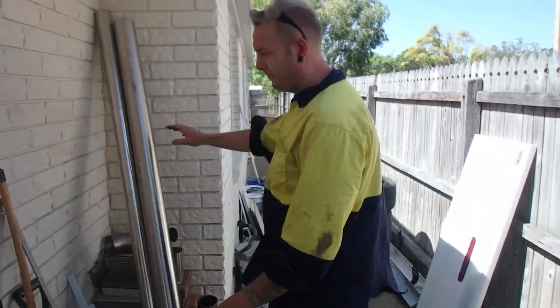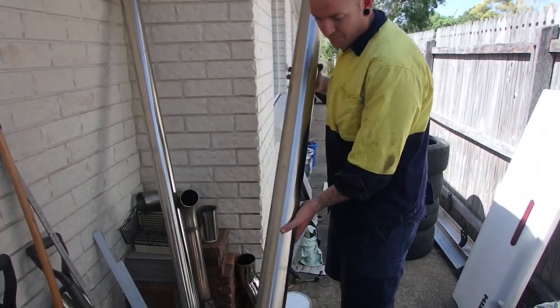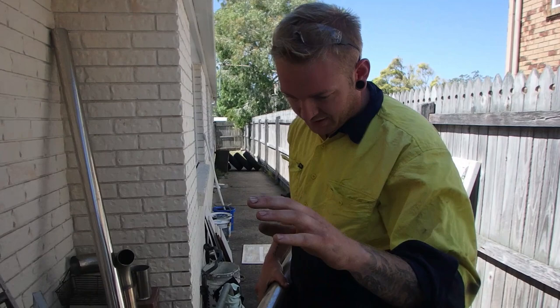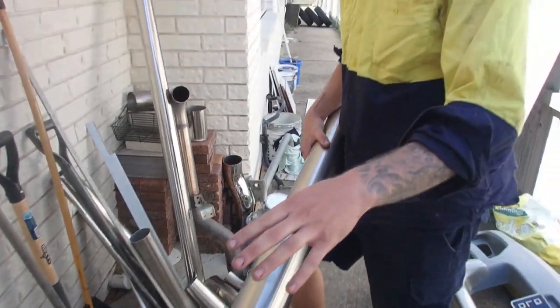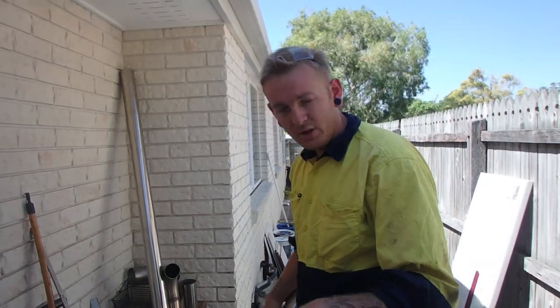What we've got here is a 4-inch 316 stainless steel tube. You can get a couple of grades — 304 or 309. Now 316 is marine grade or food grade and has got the satin finish with the lines in it. Hopefully we're going to be able to give Hayden's snorkel a satin finish. We're going to cut some of this up and get started.